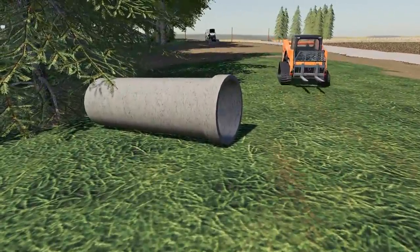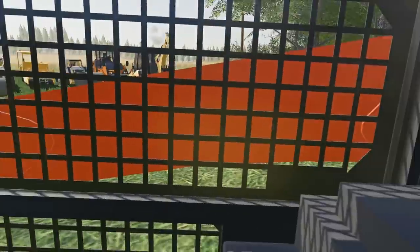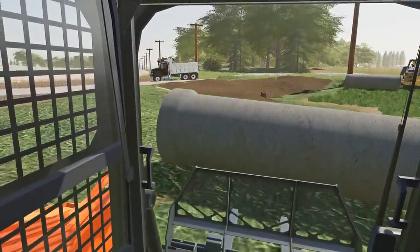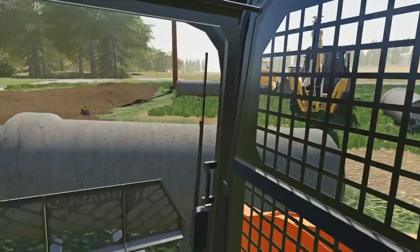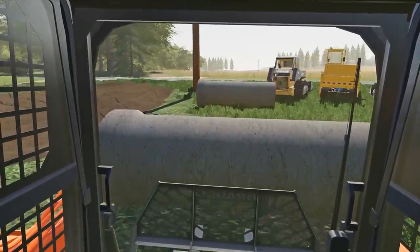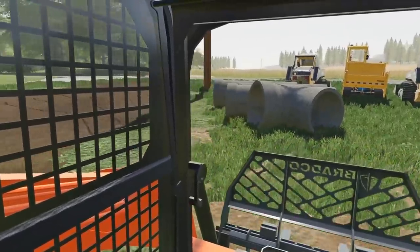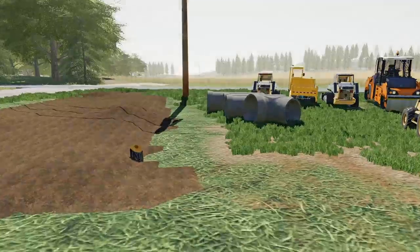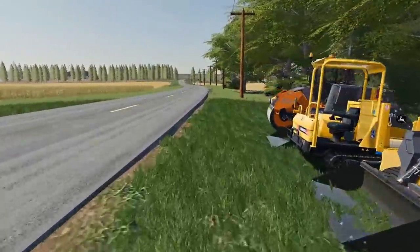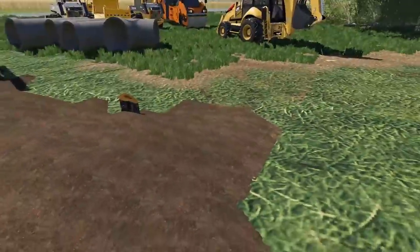These are the pipes — the windstorm came in last night and moved them. You guys can see this mixed up soil here? That's where we gotta dig with the excavators. We're just going to roll them over to the dirt and line them up. Now it's pretty much just digging this line, because we're gonna connect these pipes to the city's line that comes right underneath this road here, and then individual units are gonna dump into this main line. That's the plan.